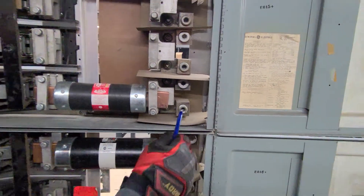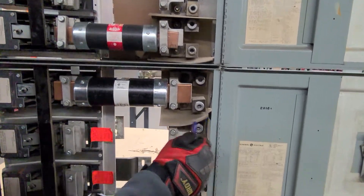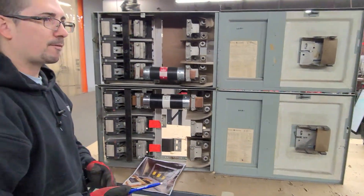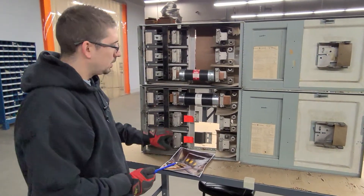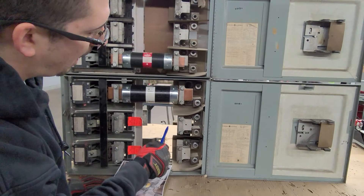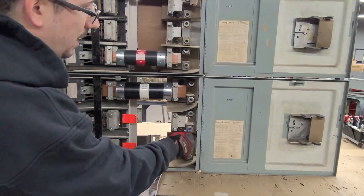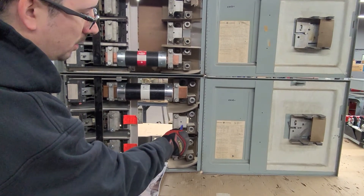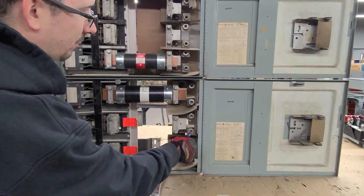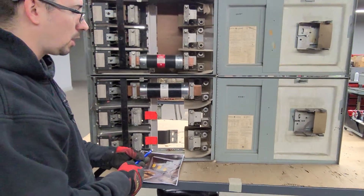You can see that this lug is spaced a little bit to the left compared to where this lug is, which is close to the frame. My recommendation to handle this job would be, assuming they have 400 amp frame fuses installed into this style switch, we'll move the 600 amp block up to accommodate this fuse. We'll provide them with the standard copper brackets that you would normally get with a 600 amp, which would move the bolt holes up to somewhere in this area. We'll also give them a custom piece that will be longer to compensate for any adjustment made for the 400 amp fuses.